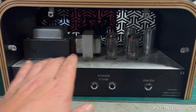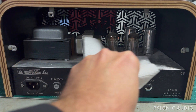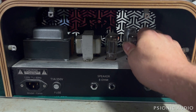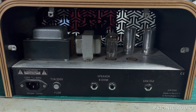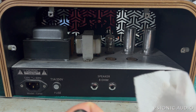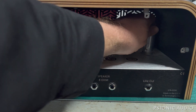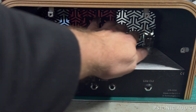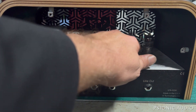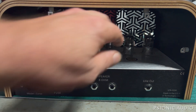Nice if you can get it. While the inside of the amp does not have everything squeezed together like a lot of lunchbox amps, it is prone to gathering dust. The output tubes are 12BH7As, so this is a very low wattage amp. One downside from a tube-changing perspective: to access the preamp tubes, you need to pretty much remove the power tubes, which typically run a little hot. And if you have big hands like me, that's not fun.